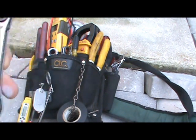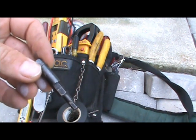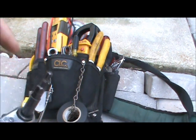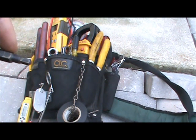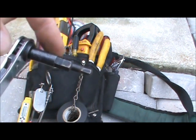The service wrench has all the different size connections. This is a separate piece that you buy so you can put it in your service wrench. For the newer systems, it has the proper size Allen screw to close off or open up the service valves. That's a separate part — very easy to lose. I keep a backup in my truck.